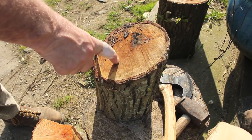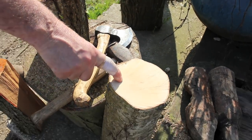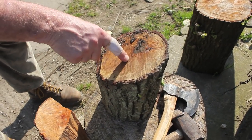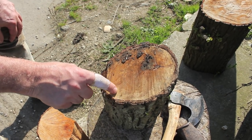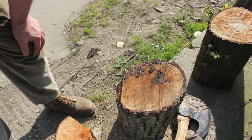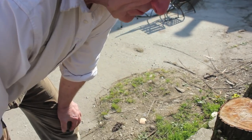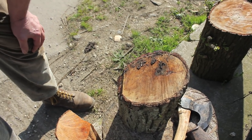The first step is the type of wood you want to use to carve a spatula. You don't need a massive amount of skill, tools, or fantastically special wood. I've got some willow on the block, some alder, and a bit of hazel here. I'm going to split this willow and see if it's suitable for a spatula — it should be because it's fairly even growth. Sometimes willow grows very quickly, and you'd see that if the rings are far apart, which might make it a bit soft. We don't want anything too hard, but also not balsa, pine, or anything like that — something like a softer hardwood.